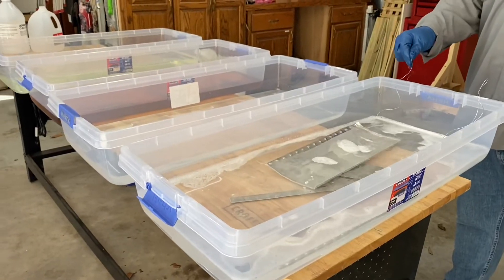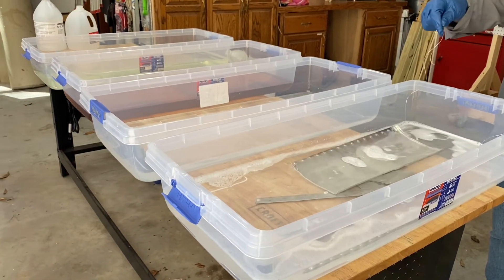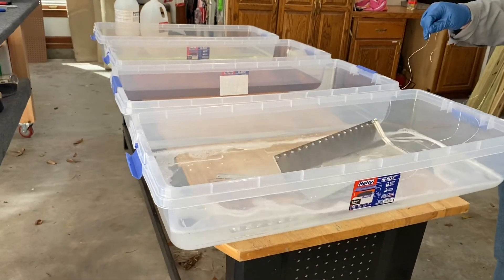For the cleaning and the acid, you have to take the standard precautions of when you're working in acid — think back to high school science class. You need to have gloves, old clothing, and goggles. You need lots of ventilation and air. I'm doing it at the lip of my garage with the garage door open and I have a fan that blows through my garage blowing out.